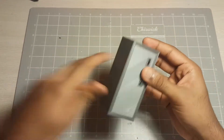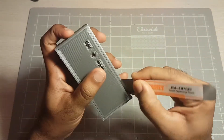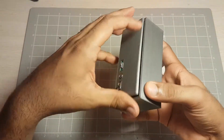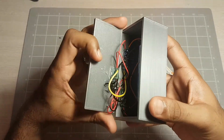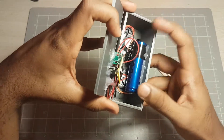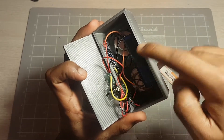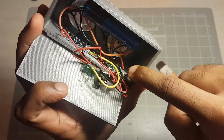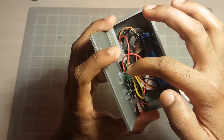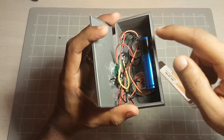There's also a battery inside. I can open this up and show you what's inside. I designed the back cover to snap into place. Inside here is a lot of hot glue, but I've got an 18650 battery cell powering this thing, and the TP4056 lithium-ion charger and discharger, along with the PAM 8403 amplifier.